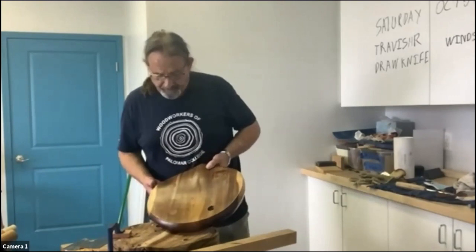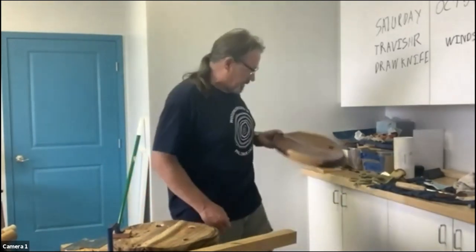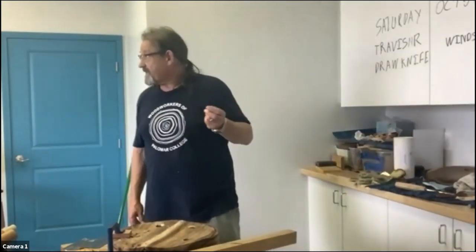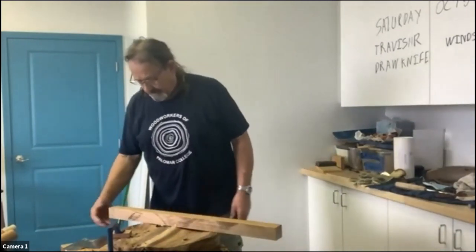Finally, what's really nice with something like this is to use blades to shape it, get the surface, and then just use sandpaper — even start with 320 and work up to 400. The reason I want to do this with black acacia is because this very fine grain with all these colors shows up so much better. When you use a blade on wood like this, you don't leave a scratch pattern. You may leave some scratches, but you don't leave something really deep because you've got a nice sharp blade doing it. And then you can sand down after that. It's just going to come up beautifully.